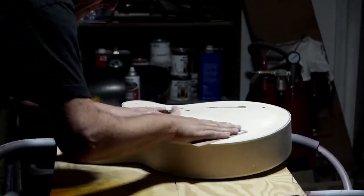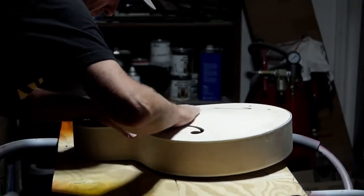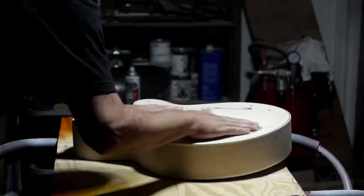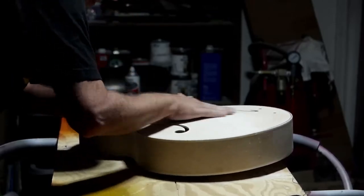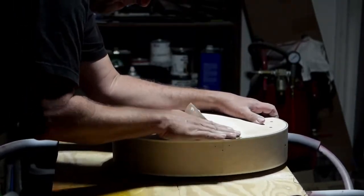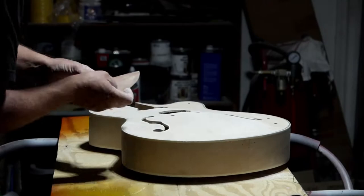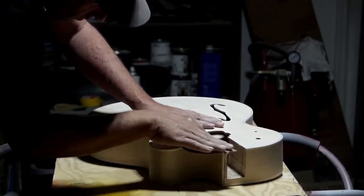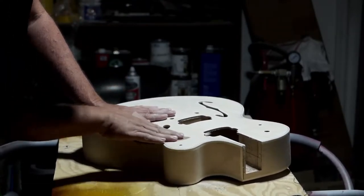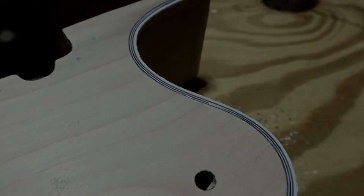Now I'm going to fire up the old arm sander and really have at it. Not only am I cleaning up the bindings, I'm also going over the shape of the guitar and feeling it out. I want the contour to remain the same all the way across. A lot of people don't like sanding guitars — this is one of my favorite things to do because you really are dialing it in and creating your base of how the rest of your guitar is going to turn out. Because this is an archtop guitar and it crowns in the center and also has a lot of contours going up and down and back around, I don't like using a power sander for this — I like to do everything by hand. I did have some issues up in here where the neck pocket is as far as the binding went, so I was able to get the binding to come back down and then sand it smooth. It did leave a little bit of a residue onto the binding, so this will just wipe off with some wax and grease remover. No big deal.